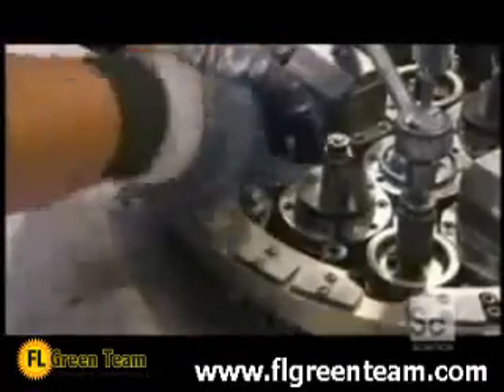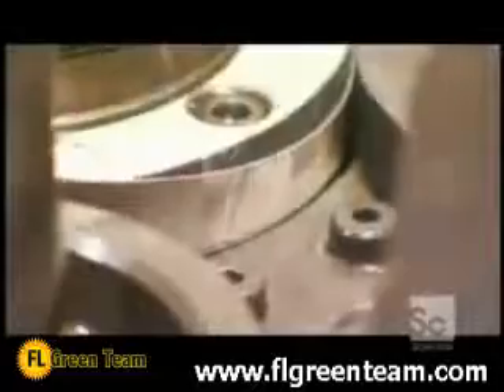To make the coil, workers position an aluminum tube called the spine in the middle of a special winding machine. Then they feed in an aluminum strip. The machine slits the aluminum strip into thin teeth called fins, then folds and wraps thousands upon thousands of fins around the spine, making a material they call spine fin tubing. Each tiny fin is a heat transfer vehicle.